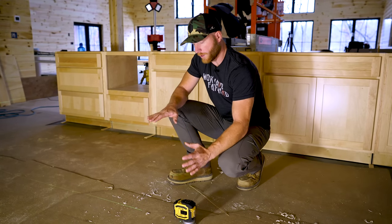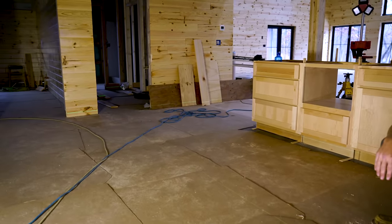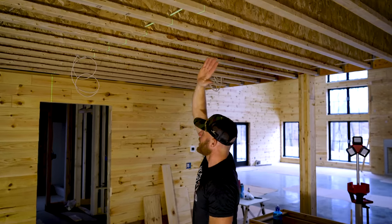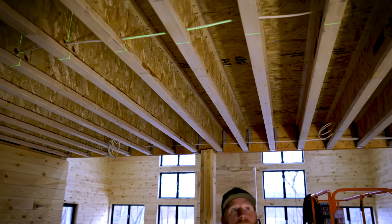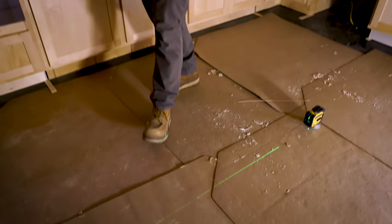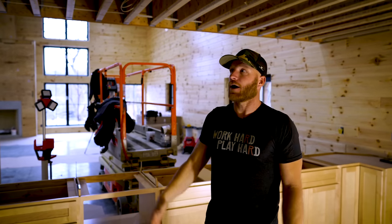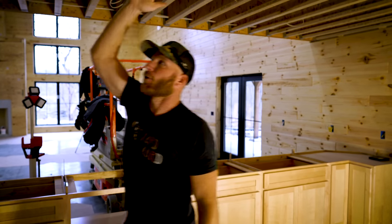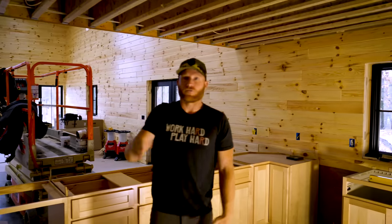The next application is twofold the way I've got this set up. I've got it set up shining a straight line, and you can see it on the ceiling and the floor. We use this laser to set up top and bottom wall plates, because especially indoors you're going to get a nice crisp line on wherever your top plate is going to go, and a nice line on the floor for your bottom plate, ensuring a perfectly straight wall that's going to be perfectly plumb. The second side of this setup is that if you're in a kitchen and you're an electrician, it gives you a straight perfect line if you want to install a bunch of can lights in a line, or you want two or multiple ceiling fans to line up — you're going to get a perfectly straight line in order to do that. It's a great asset for laying out anything on your floors or ceilings.